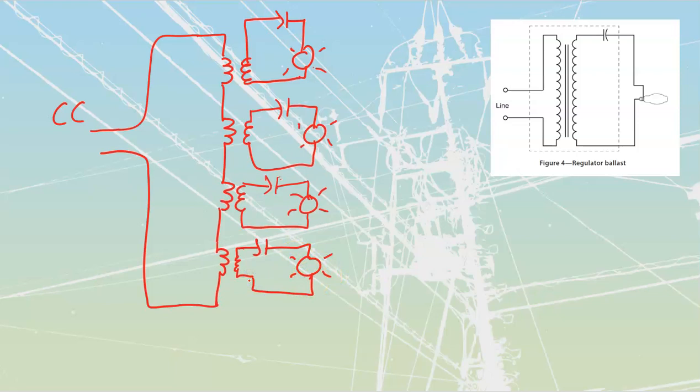All right, that's what we are going to have. Now these lights, these actual light standards, are going to be hundreds of meters apart. You've driven down freeways before and you've seen these things. So we're going to have a high value of voltage over here. Let's say that this value of voltage that I'm going to be placing out on these is going to be 12 kV. That's 12,000 volts that I'm going to have.